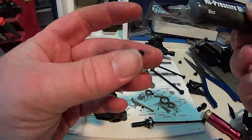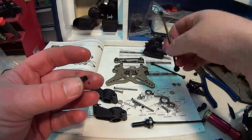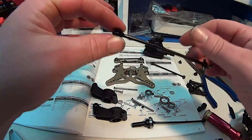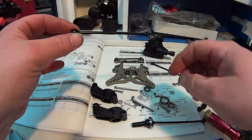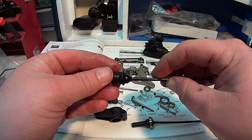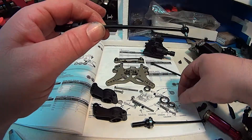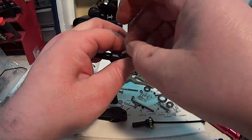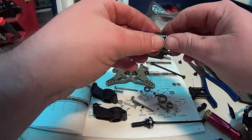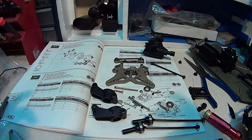Get the barrel and a little black grease — high pressure grease is what they call it — and then slide it in. Make sure you can see through it. The same way as before and it's repeatable. Got that small pin again. You may have to rock this back and forth to get it to line up, and then the bearing goes on. Now it's captured so we don't have to worry about that falling apart.